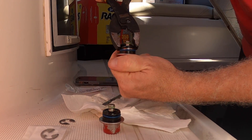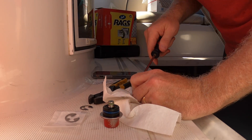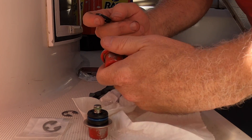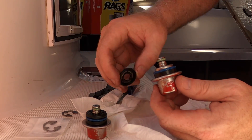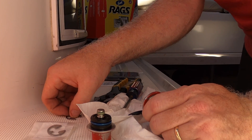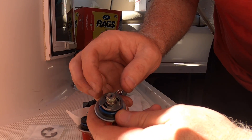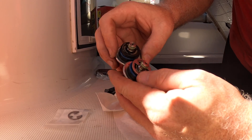I'm just grabbing the top. Gently pry — pry is not a pull, right? Okay, it's coming out. I need a break in the screen — you can see that. Kind of cracked the screen, which obviously is fine since we're replacing it. This looks like it's all intact. Then the e-clip needs to slide in here. There's one with the screen and one without the screen. I'll cut both of these off.